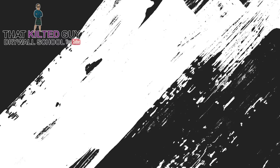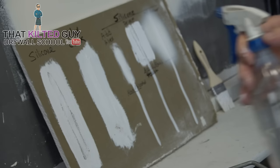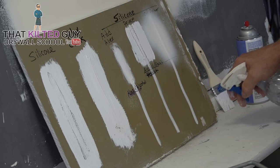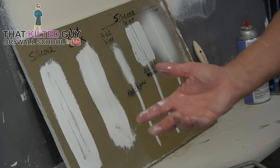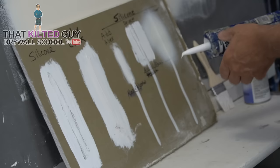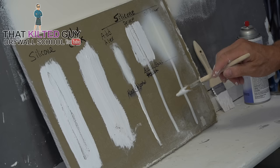For the oil primer I'm going to be using this Sherwin-Williams Pro Block spray primer — it is oil-based, shaken up well. You can see that one is beading up really badly with just the water-based primer. Now let's go ahead and treat the remaining strips with alcohol. Here's some denatured alcohol in a spray bottle — I use this fairly often for cleaning. You can see it's making the marker ink run, so we're going to let those dry, fan dry them a bit, then go ahead and put the Alex caulk on one and the Zinsser primer on the other.